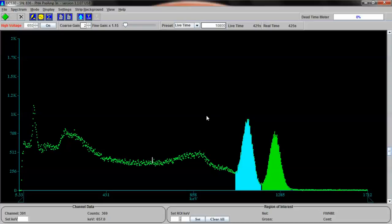All right, I'll explain what all of these are in a minute, but let's start with the two primary photopeaks. This one right here, according to the spectrometer's calibration, is occurring at approximately 1,122.474 kiloelectron volts. The real energy that this should be is 1,173.24. So we're off by about 50,000 electron volts, which is not very much. This is pretty close to dead on.